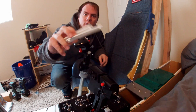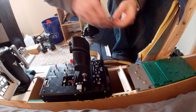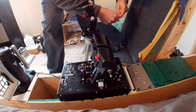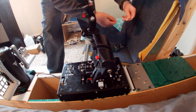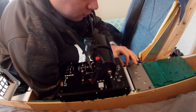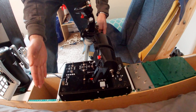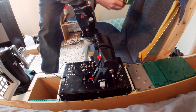These little 3D printed brackets are done — let's install them. We don't tighten quite yet; we need to get all four on both back and front before we can really tighten because that'll square it up. The reason I slotted these was because of exactly this — this front one is actually going to have to come out a little bit. If I would have made them the perfect size, they wouldn't have fit.